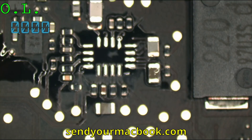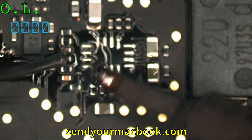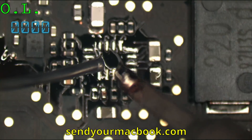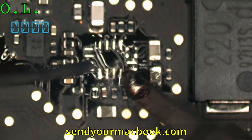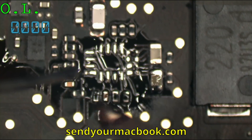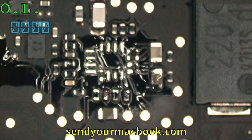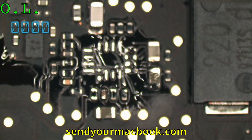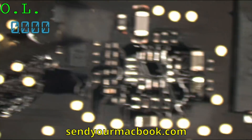So to avoid having to add solder later, I'm going to add a little bit of solder to these pads. Hopefully I increase the solder a little bit. We're putting a brand new chip on here so it has no solder on it — so it's either we go around afterwards or we add some now. I prefer going around afterwards, but as shown in the last video, this is a really tight area. I'll dip this in a little bit of flux — I have a little pool of flux — and just dip it in there and pull it back over.